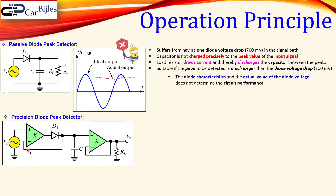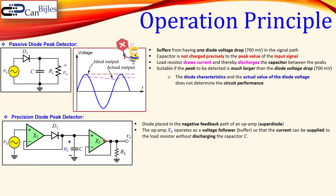This circuit requires power for the two op-amps X1 and X2. What you see is that this circuit includes our super diode, which is also used in precision rectification. We have a capacitor and a load, and X2 is there to unload the capacitor, providing a high input impedance between the capacitor and the load. The diode placed in the negative feedback creates a super diode, and X2 operates as a voltage buffer or voltage follower, so the current supplied to the load does not discharge the capacitor.